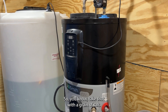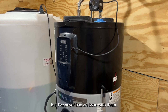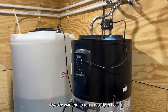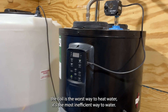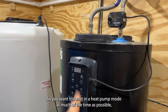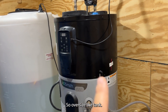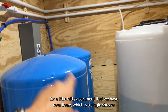Take that with a grain of salt — maybe they're having problems now, maybe they had problems and got them fixed, maybe I was just lucky, but I've never had an issue. There are several manufacturers of them. The second thing I'd say is if you want to run it mostly in heat pump mode — which you do, because the regular electric coil mode is the most inefficient way to heat water — you want to run in heat pump mode as much as possible, which means making as much hot water in reserve as you can. So oversize the tank.